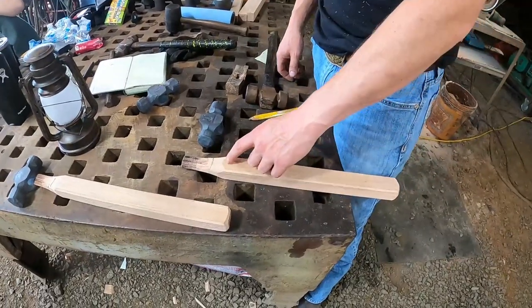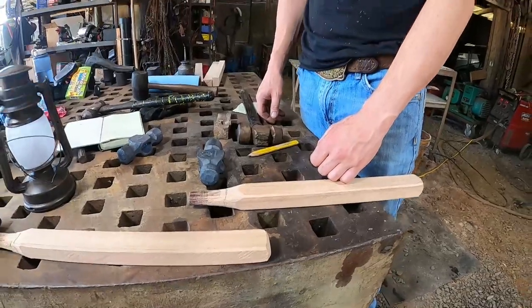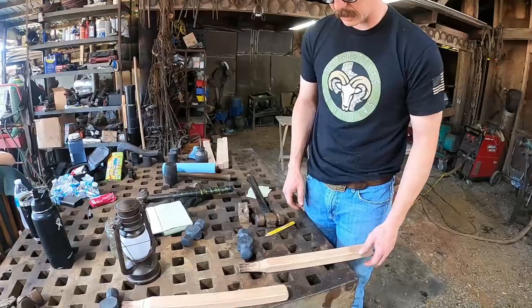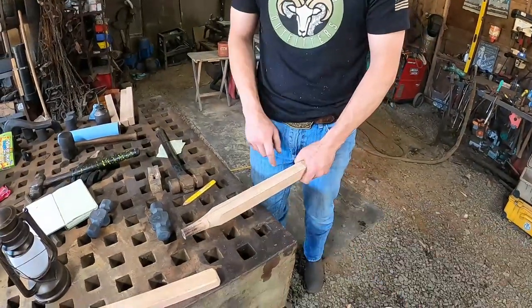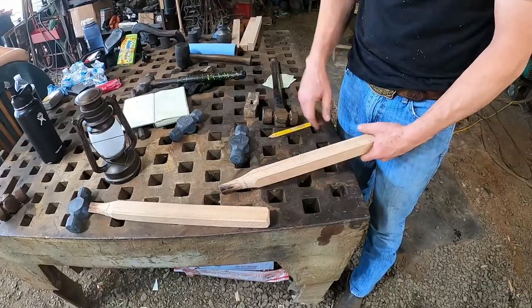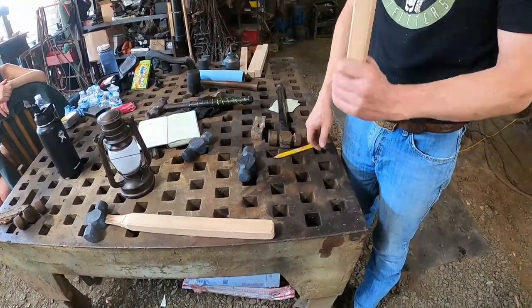at the base. Two things for that is that it gets a little bit of vibration out of the hammer. It lets the vibration happen where it's the weakest, where it's the thinnest. Oh, so it's not vibrating you here. Yep, if you have a straight stick, you hit something, you get all the vibration right into your hand. But if you have a little bit of a vibration dampener, a little bit of a break, some spring happens there, it can break there, but handles are cheap, elbows are not.